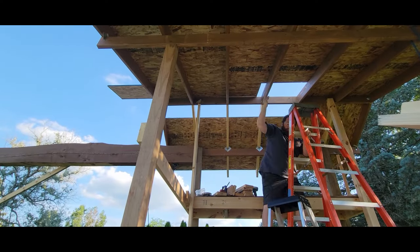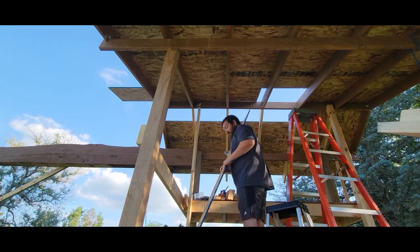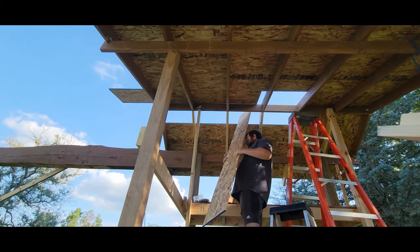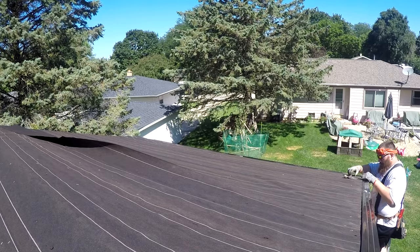Here I am putting the last couple sheets of half-inch OSB on the roof, and then I laid a layer of felt paper on. Here I'm cutting it out. It's so much easier to pre-cut these. I finished putting the felt paper on at 10 o'clock at night — it was going to rain the next day so I wanted to keep the OSB protected. Now that we're done with the felt paper, let's climb on the roof.